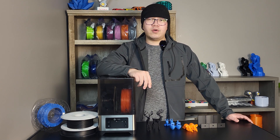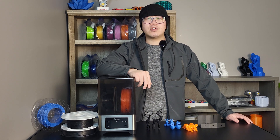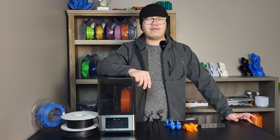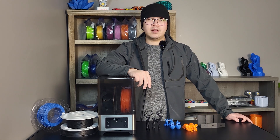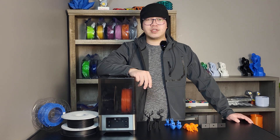How you store your filament is extremely important. I normally keep my PETG, TPU, and more expensive filaments in a sealed bag with a desiccant. I have also kept my regular PLA in my room for years without any issues. But some filaments like nylon carbon fiber absorb moisture very fast — exposing it to humid room air during printing could already cause issues. Even some brand new filaments might come in wet conditions. In that case, a filament dryer could solve your problem.